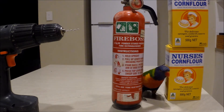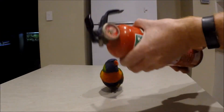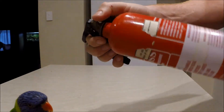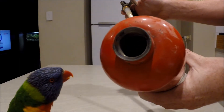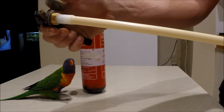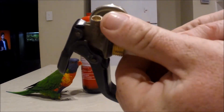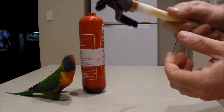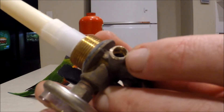Let's get started. You need to get your fire extinguisher — these ones just unscrew at the top like so. You have your head piece and then your empty cylinder. Now you have this part here, so you can always check the seal, make sure it's not torn or ripped, and you can add a bit of oil or silicone spray to grease it up so when you put it on it's not going to tear.